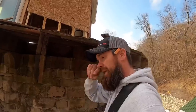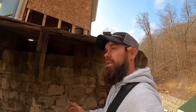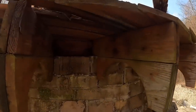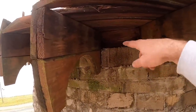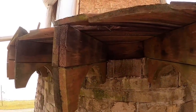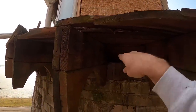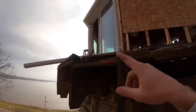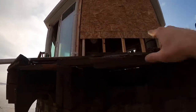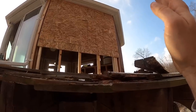So we're definitely going to be cantilevered, or should I say the cantilever will be less than 50%. So that should work out pretty darn well. Now I just got to figure out, you know, I don't mind walking on that concrete ledge up in there, but I got to figure out how to get this off to be able to get in new joists that we're going to square off of the walls that were framed around, square off of this back wall. So that's going to give us our point coming this way.